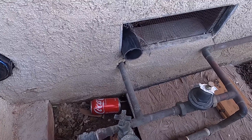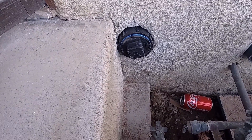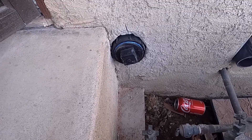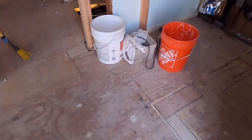The minimum on a main clean out is three inch. So I changed it into three inch, especially because I have a building inspector here. And the clean out is connected there.